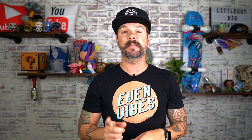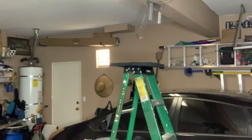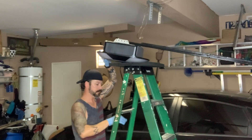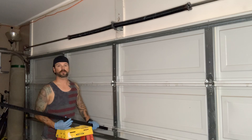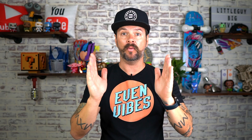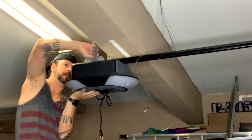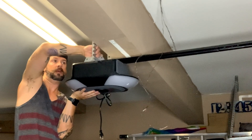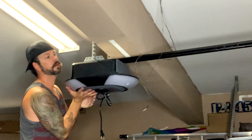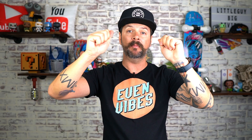Step eleven is going to require two people or really tall ladders. Since I only had myself, I got a six-foot ladder and put the motor mount on top of a pad very carefully, laid it up there and put the other end on a four-foot ladder. The brackets I had to move — I pre-measured the width of the garage door opener and mounted them but left them slightly loose, so when I lift the garage door opener up I can put the screws in hand tight, spread it open or close to make sure it fits well, then tighten everything up nice and snug.